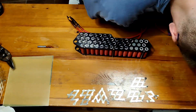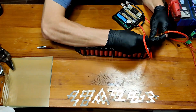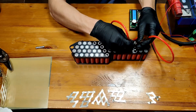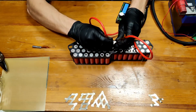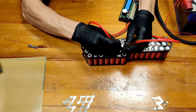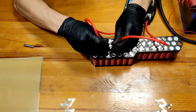If you can, make sure to use gloves and clean up the connections, the nickel strips and the cells, so that we get a very good surface to spot weld over. Making sure you use gloves will prevent oils from your hands from going into the cells and ruining your weld.